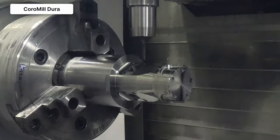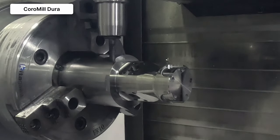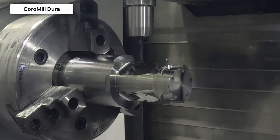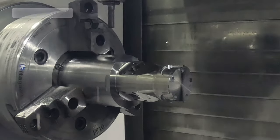Next, we stick with solid round tools. We came in with a four flute whisper cut and did the flats on the collar — we went in and pretty much did a full slot with that whisper cut end mill on all four sides. Then we moved on to turning, and we cut the undercut behind the collar with the new CoroCut 2. We did a plunge turn method.